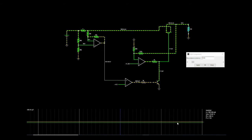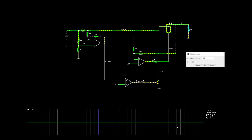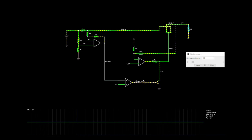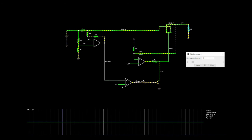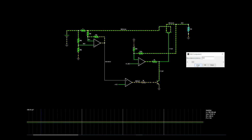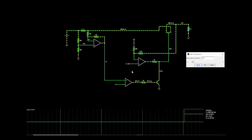I've got this stuff right here that will show what this is doing. So I think the yellow is the current and the green is the voltage. Anyways, I'm just on this wire down here in the scope. So let's go send this thing to 10 ohms, so it'll go into a current limiting mode because we're just looking for 1 amp right here. Apply. And see how now we have 1 volt here, 1 volt there, 1 volt on the output.